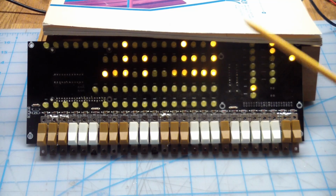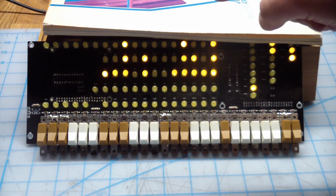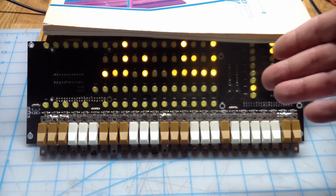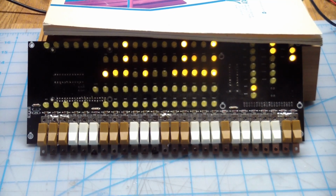And or even before that, do a cheap test and see if at least we can light up the LEDs by removing the Pi and then basically applying a voltage to each LED and seeing if it lights up. Because if it's not running, you give it your 5 volts or 3.3 volts or whatever, connect it correctly, and the LED should light up. And if it doesn't, then the LED is dead. Now, this happens very rarely that an LED dies, but it does happen. So let's get set up to test the LEDs.